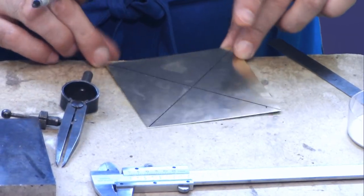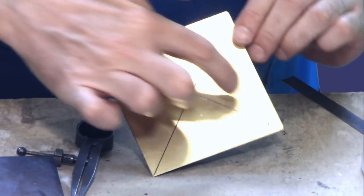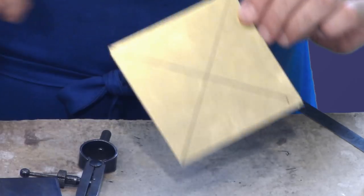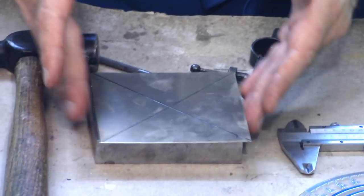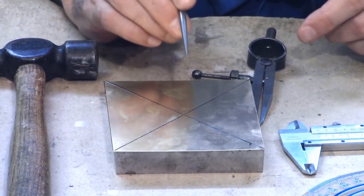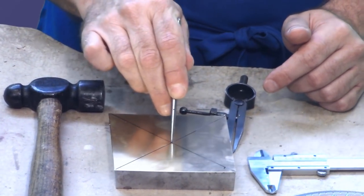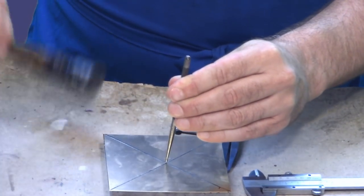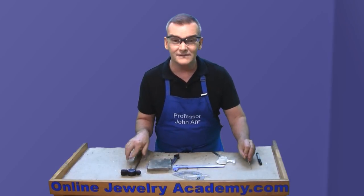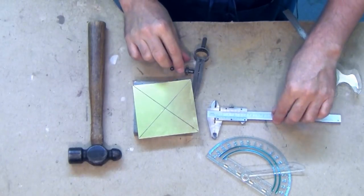You can clearly see that on the surface of my piece I have right angles, and I want to take advantage of these angles. I'm going to place this piece of metal on top of my bench block, and then I'm going to take the tip of my scriber and put it right where they intersect. Taking my hammer to strike, I'm going to create a kernel. The kernel is like the kernel of the truth — the center of it, where it all starts.